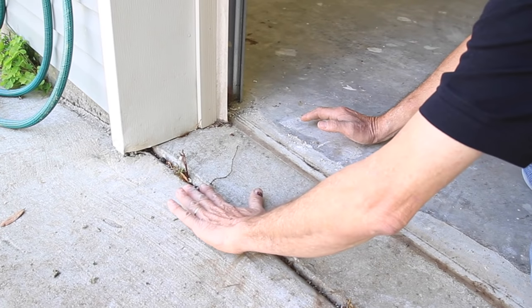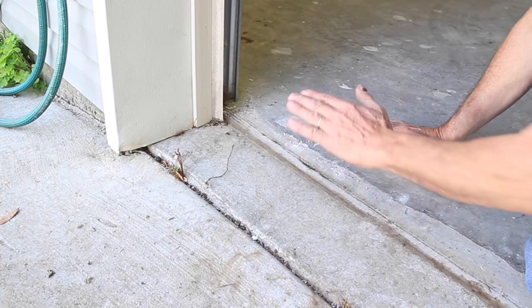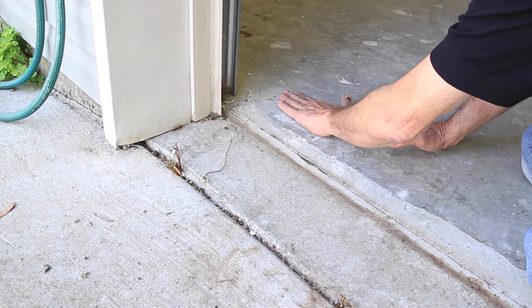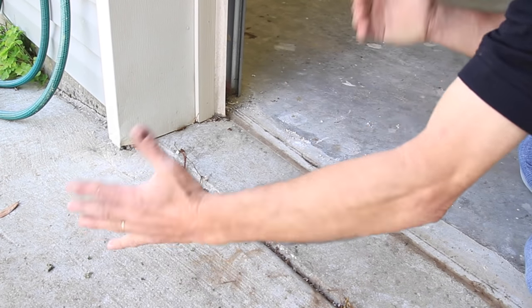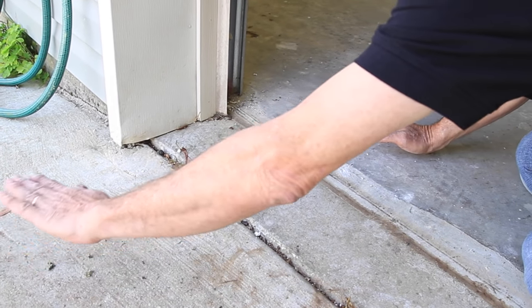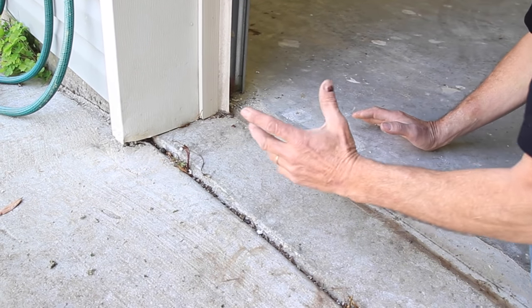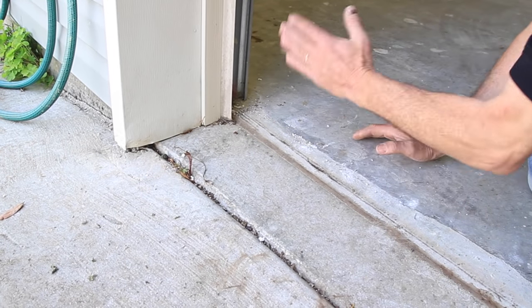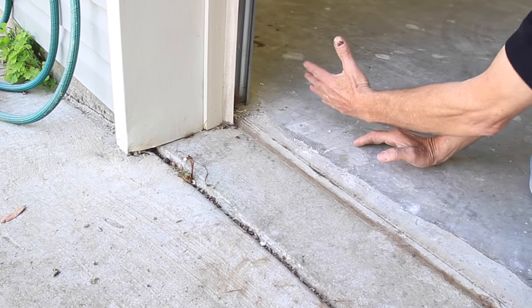You can make your concrete flat, but what you don't want to do is have the elevation of this concrete go flat out and then come down. And to complicate problems, they'll make the concrete butt up against it or even come inbound. That is a formula for water coming in, because that rubber on the bottom of the door will not hold back that wave of water.